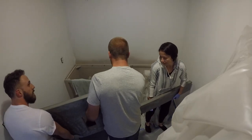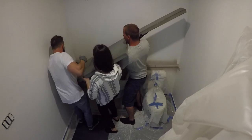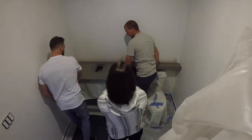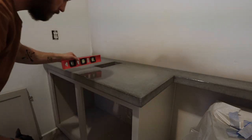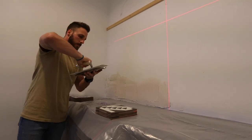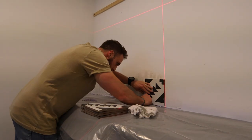With some help I lowered it in place. As you can imagine this would be pretty heavy so make sure you have some helping hands. It's also a good idea to add a bead of clear silicone to the top of the cabinet base. I did one last check to make sure it was level and didn't need any wood shims — lucky me it was perfect. Now that the countertop is installed I laid tile directly over the top of this, but I will be showing that in its entirety in another video.